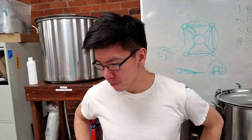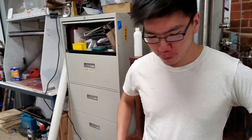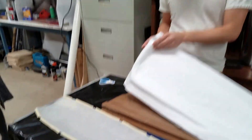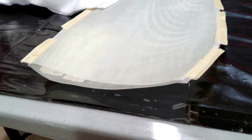You leave the vacuum running so it keeps pressure on it — you want to hold the vacuum until the whole epoxy cures. For this it's like 10 hours. And why go through the process? Just to get an ultra thin, ultra strong formed object? Well, you need a mold if you want to make anything to the shape of that part. It doesn't matter how thick or thin you want it — it's just the process. Well, it looks like you've made some beautiful fins. It's a very cool and educational process to see.